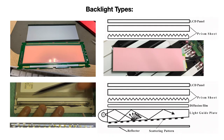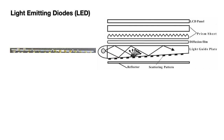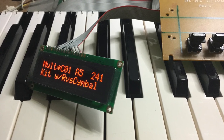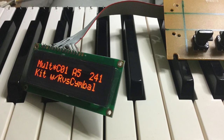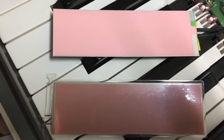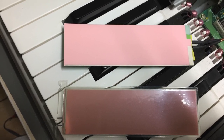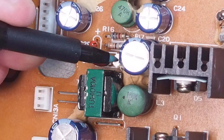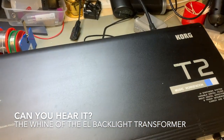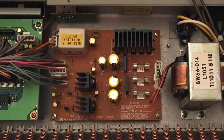There are basically three types of LCD backlights. First, electroluminescent foils — actually a very large, paper-thin flat capacitor with one transparent side, where the dielectric is a phosphorus-based material that lights up when a high AC voltage at high frequency is applied. This voltage is supplied by an inverter that also often causes the whine one hears when it operates. These are not used anymore because they do not age well and need additional electronics for the high voltage supply — just too much trouble compared to LEDs. However in the late 80s and early 90s they were heavily used as backlights for large LCDs, as in the Korg 01W or the Yamaha SY77.